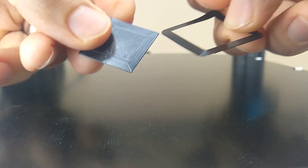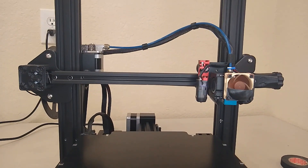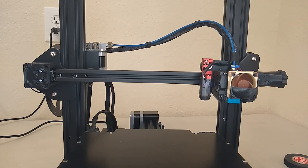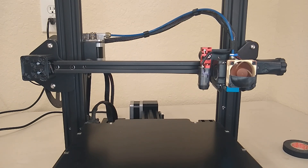If the brim comes off, then we're right on the money. This is a zero Z offset — it doesn't get any better than that. The reason for setting it up this way is that when you create your mesh in either Klipper or Miguel's Professional Firmware, the actual measurements the probe takes become your bed mesh, with no additional calculation or addition or subtraction of Z offset needed. In the past, a Z offset would throw off all your bed mesh measurements, making them unreliable, and when you tried to print on the whole bed you'd get lousy results.